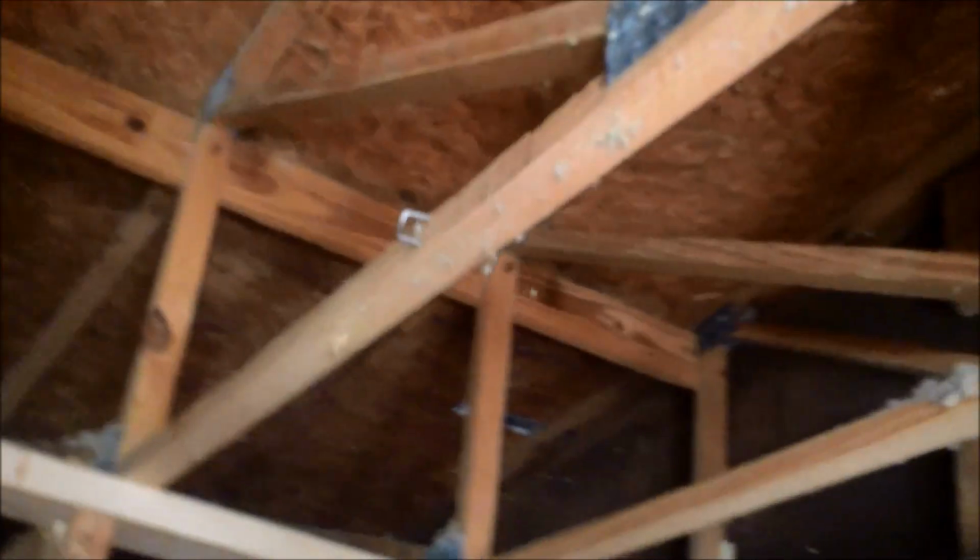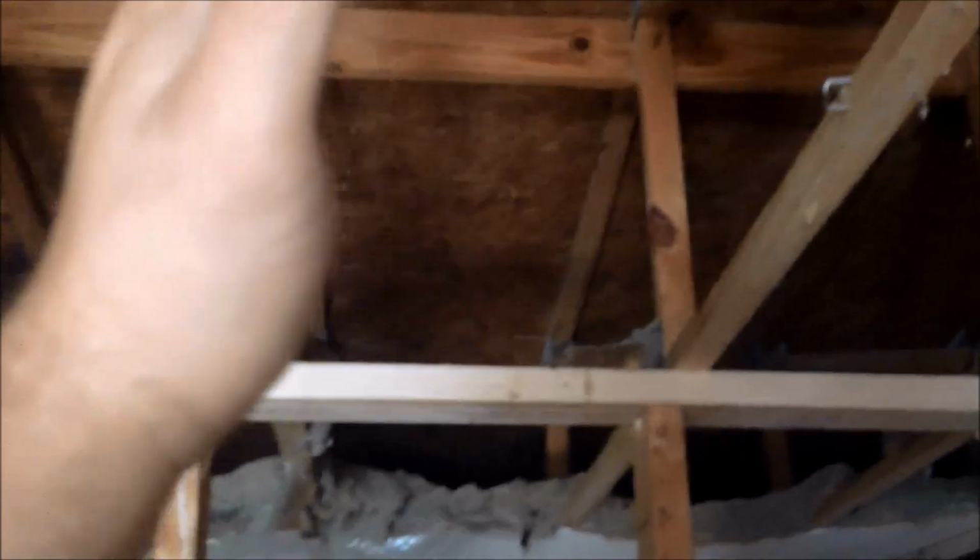And you gotta think about placement. You can't put it directly above a shower. You don't really want to do that. It's too much moisture. So the shower's over here, the toilet's right here, so it's about 2 feet from the toilet, it's about 2 feet from the shower. And so that gives it a good clearance, I think.